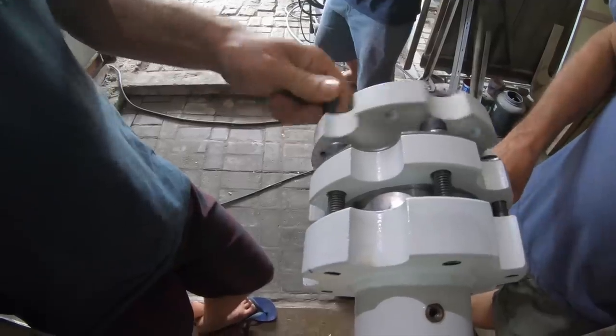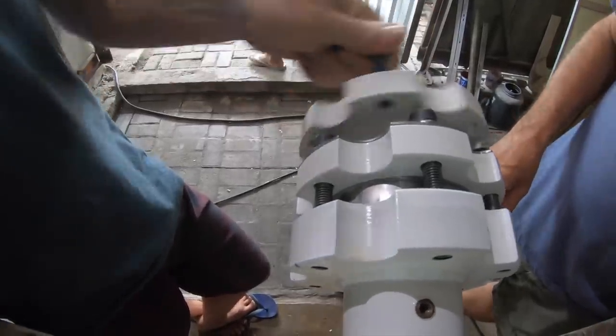Then we installed the shaft, and then we put some oil, and when we tried to turn the bearing, we could feel like a little bump. We turn, bump. It took like three times assembling the entire system to find it, on the last second, on the last image we showed you. That's exactly when we found this bump. And probably that is another reason why the system was making noise, because a tiny bump when you spin one turn is one thing, but when you spin 1500 turns really quick, that's a completely different thing.